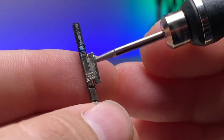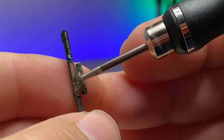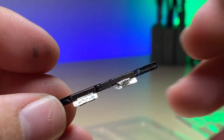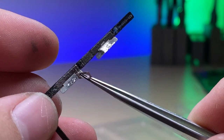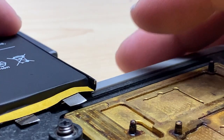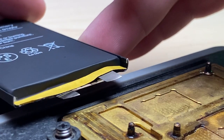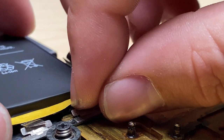Now this next part is pretty straightforward. I'm just going to carefully grind off the old tack welds off of the old leads with this little grinder until it looks more like that. Now do the same to the other side — a lot of the time you can just grind right through it so that it pulls it off just like that. I'm just going to smooth out the marks there. From here I'm going to get some type of metal base that's conductive, like this brass heat plate. I'm going to line up one side — we don't want to cross over the two leads. So I'm leaving one off the conductive surface, and then we'll place our anode and cathode over the leads.